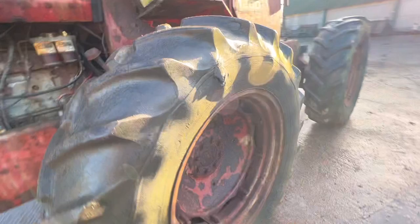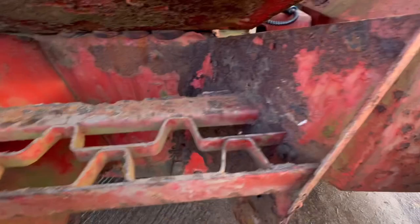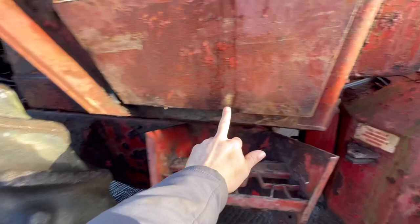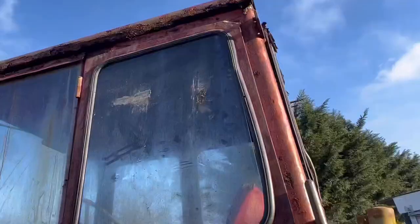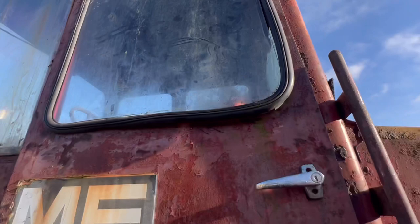These steps are obviously rusted away, but it's only flat steel — two or three mil folded — pretty easy to make. The bottom step is in the cab. The door fell off when Tom loaded it on the wagon because it swung round, hit the tyre, the tyre flicked it up off its hinges and it landed on that corner — that's that dent. But it didn't smash the glass. The glass has nearly fallen out, mainly because of that and also because I pushed on it yesterday, so that one's clipping back in before it falls out. The window has obviously been broken at some point and been replaced by perspex.